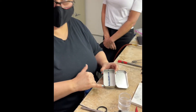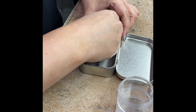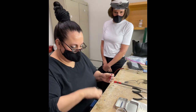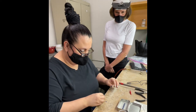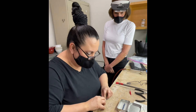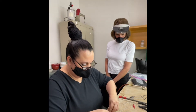We have all the stones lined up. I'm going to grab the first one and work right in front of us. I usually put a little tiny dab of wax on the bench, or you can use double stick tape, so that I don't spend all my time on the floor looking for my stone — because that's what they like to do. Remember with the wax, don't get carried away. If you use a big lump of wax, it'll just become so messy that it'll be counterproductive.